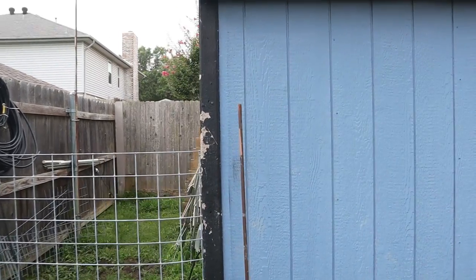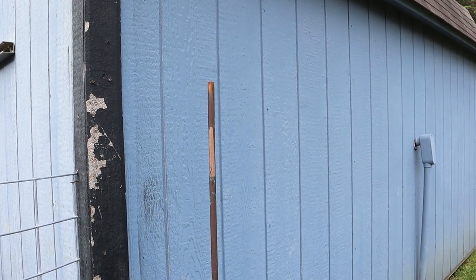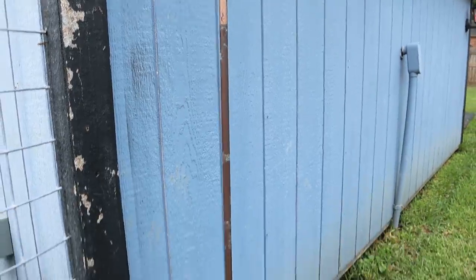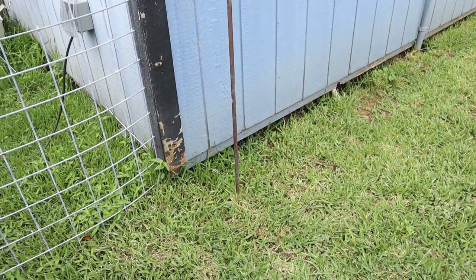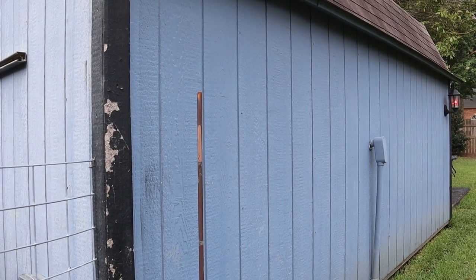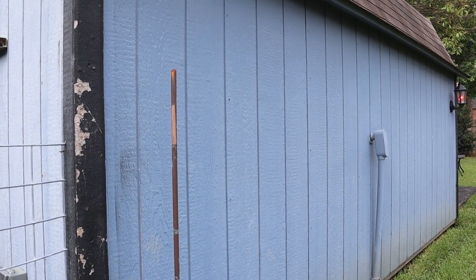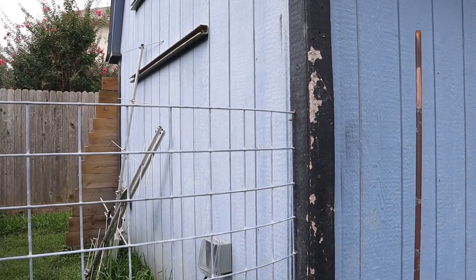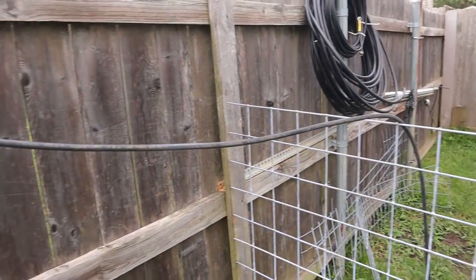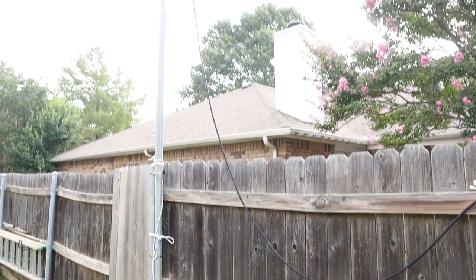Right next to the electrical line here is a standard copper — I think it's an eight-foot copper rod — buried in the ground with less than five feet out of the ground right now, buried in there a little over three feet. That's where I'm going to put my coax coming out of the shack, with ground connections and lightning arrestors on it. Right now this is the LMR 400 coax coming out of the shack, running along the fence up to the antenna.